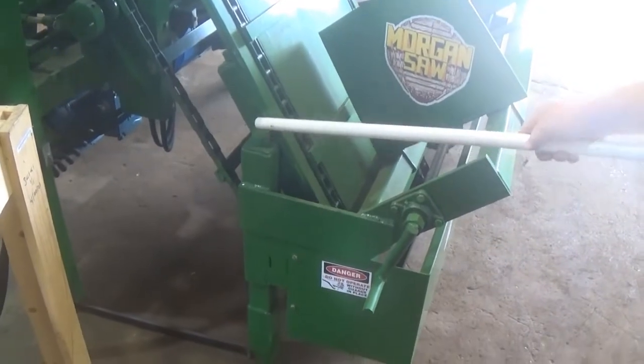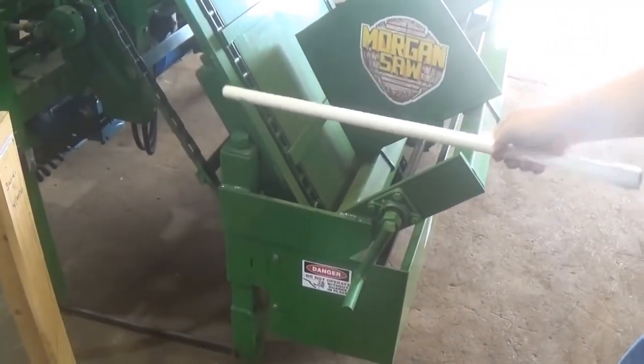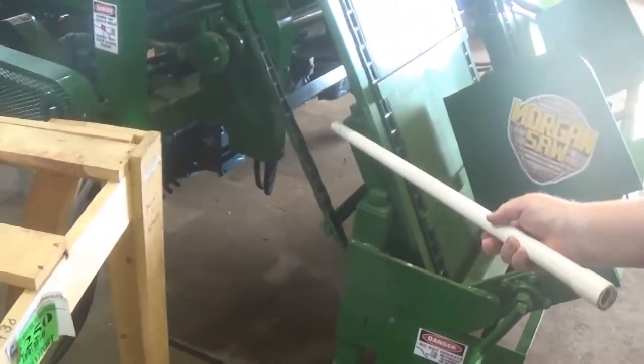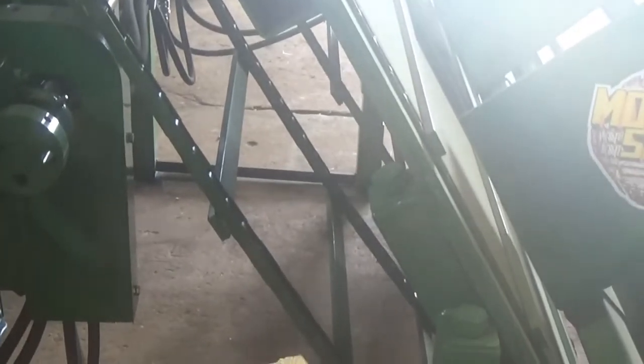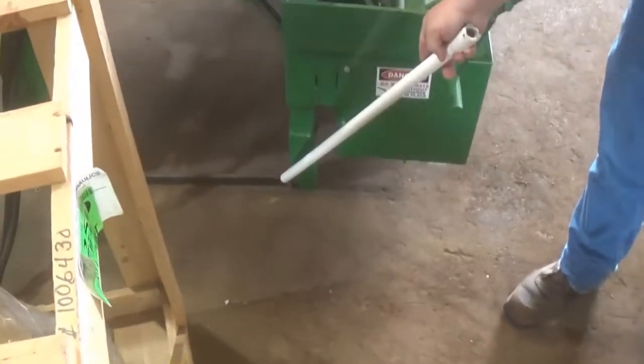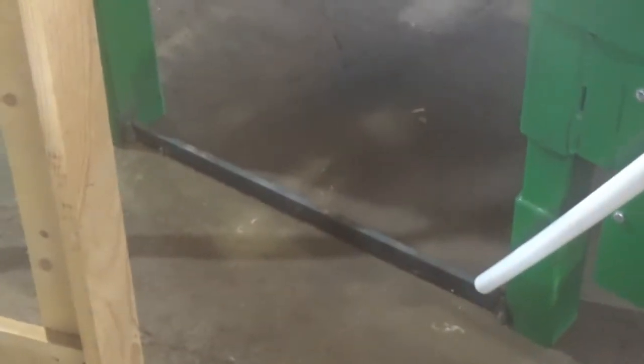This is just a little bit of adjustment on the angle for the unscrambler. And this one here is the tension chains on the unscrambler. This piece down here you need to remove once you get it in place — it's just temporary so we can handle and move it as one piece.